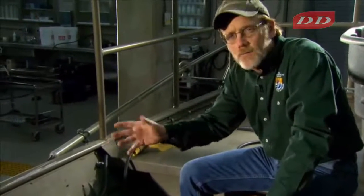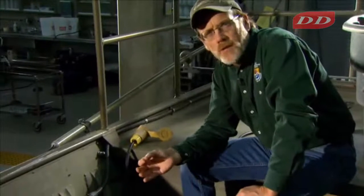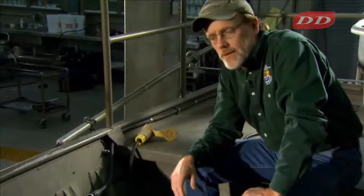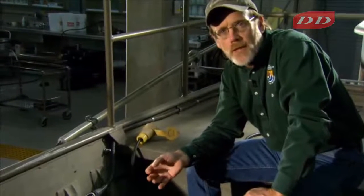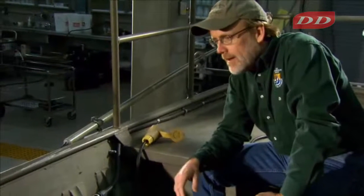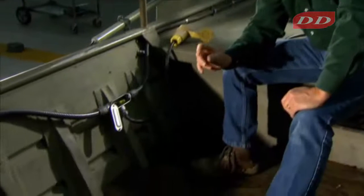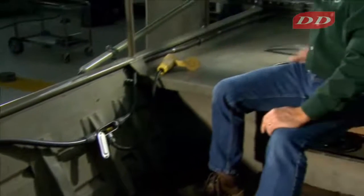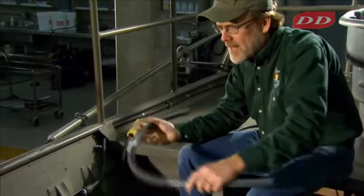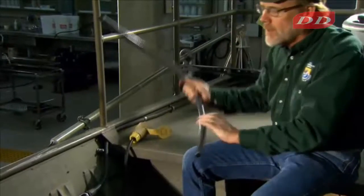Okay, from the control box, the electricity passes down conductors, wires, and the wires need to be a particular gauge to handle the amperage that you expect your unit to generate. So typically 14 AWG, American wire gauge, to 9 AWG is used. The insulation is rated for voltage, and we run the wires in flexible watertight conduit. And here's a piece that is very flexible. It's easy to attach to the side of the boat and run wires through.